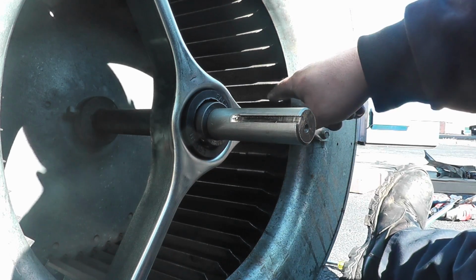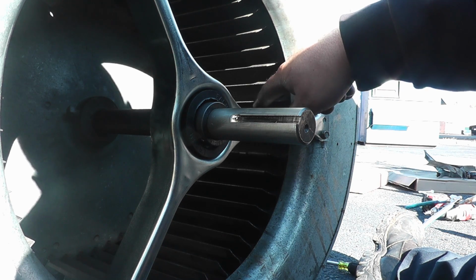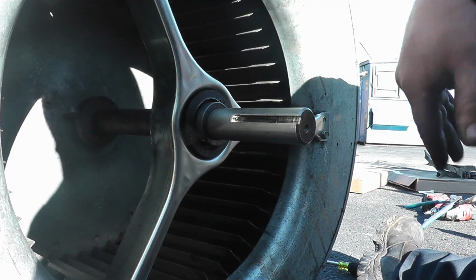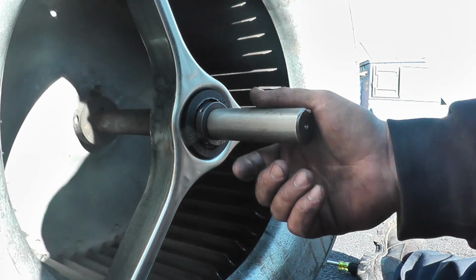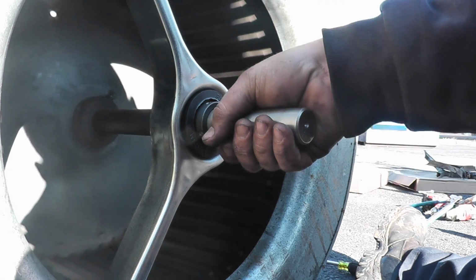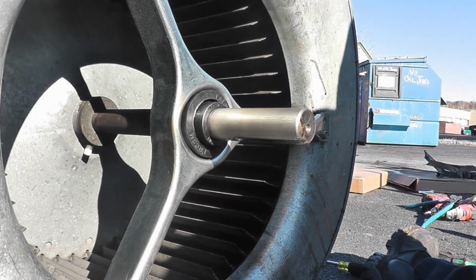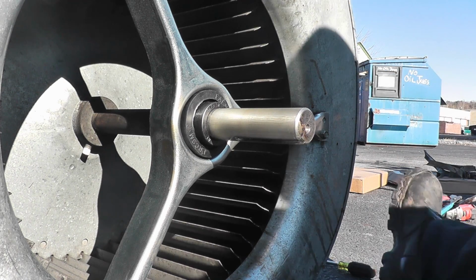Like I said, we have some dust and dirt in here, but not that much. You're gonna do more detriment trying to clean that off, because right now it's balanced. All that dirt from it spinning balances out the fan blade. You try cleaning that, you end up cleaning one spot more than the other, and you're right back to where you started. So let's trek this up the ladder. We'll get it back into place, and then we'll adjust the top belt.